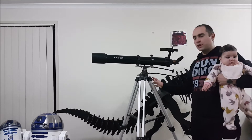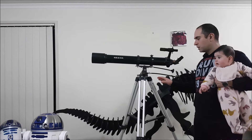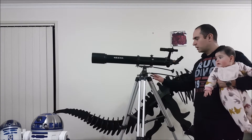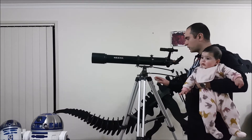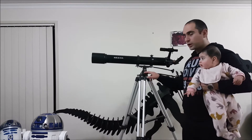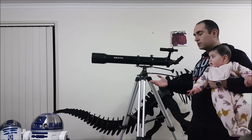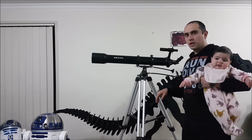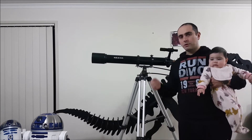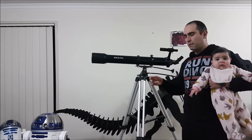The telescope is actually made of really heavy-duty material; it's pretty sturdy, some parts are pretty heavy. This is actually a very heavy-duty alt-azimuth mount. What I'm finding really surprising is that nothing moves — the slow-motion controllers don't move. It looks like it's all seized, with a whole lot of rust build-up and gunk over time. It just means that nothing's working at all, so it'll all need to be stripped down, taken apart, cleaned up, and reassembled. I went and printed a copy of the manual to get a better idea of how to use the different parts, but the manual wasn't very helpful.